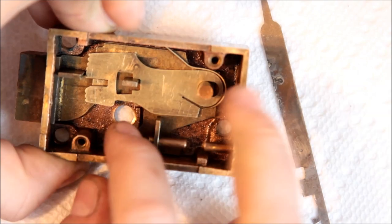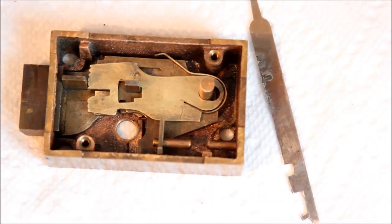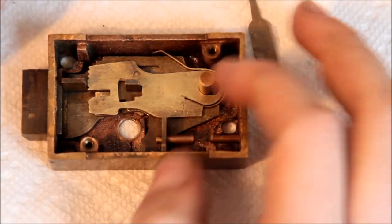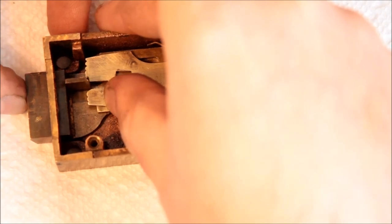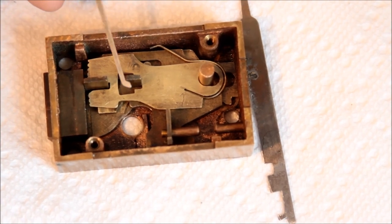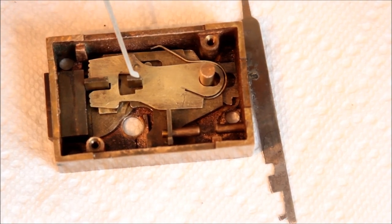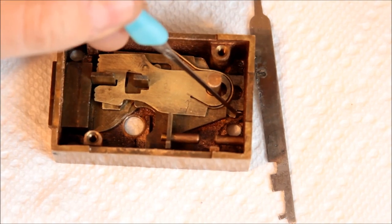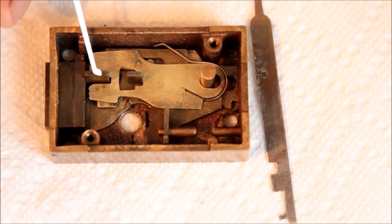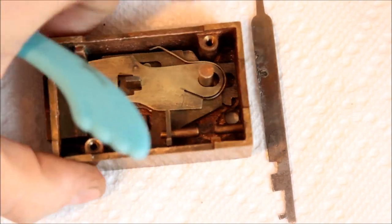The renter would come in with his key, and there'd be a bunch more levers. His key does not have a bit to engage the secondary bolt — it has a bit to engage the primary bolt — and when the renter has their key in place, that bolt is able to move. So this lock is novel in the sense that, at least in the patent, it has two separate mechanisms — it's really two locks in one. You have the secondary lock which releases the dog (which isn't present in this particular instance), and then the standard primary bolt that allows the renter key to actually unlock and open the door.